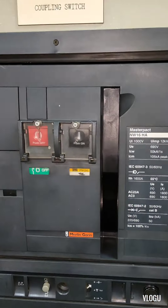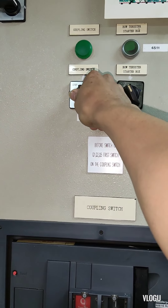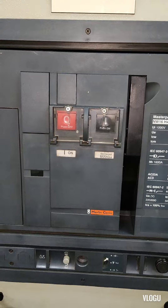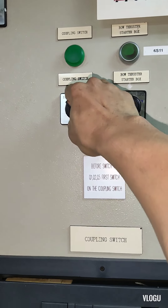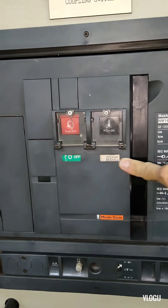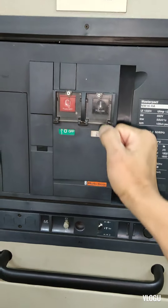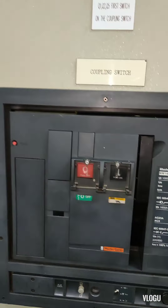After pumping, you check the charge level, and then you can switch on the circuit breaker by remote or by manual. Now I'll demonstrate: on and discharge — switch off and discharge — repeat again. If you want to switch on the circuit breaker, pump seven times: one, two, three, four, five, six, seven. Okay, now it's charged — you can switch on the circuit breaker.